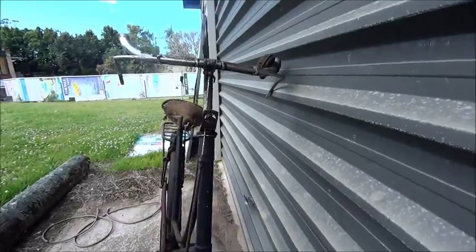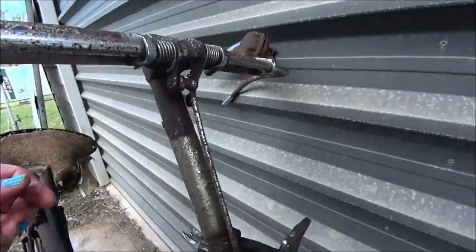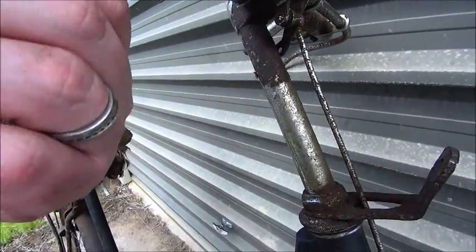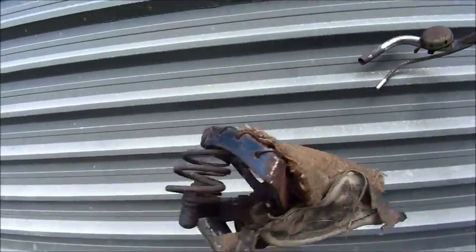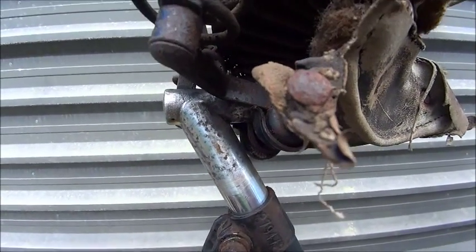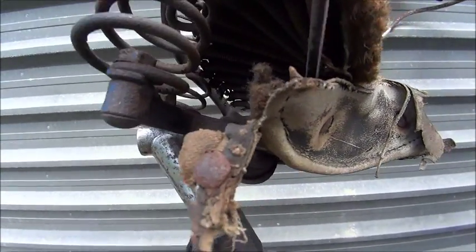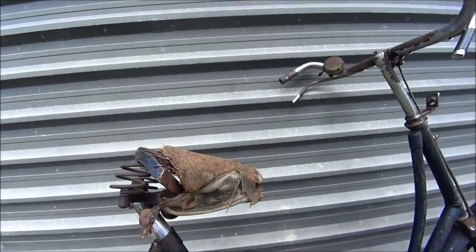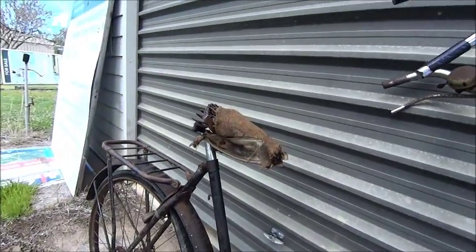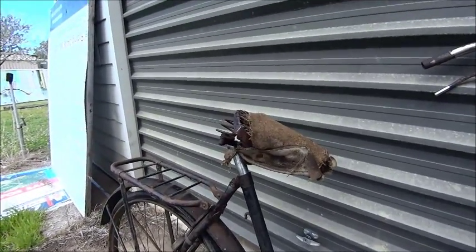Apart from that it's just a matter of pulling things down and stripping them back. I'm not sure how the frame is going to clean up — it's quite pitted. I'll drop it in the electrolysis bath. I've already done this one and given it a rub up with some emery cloth but it's still quite pitted, so I'll have to think about that — there must be a way to fix it. Anyway, that's an overview of what we're going to need to do to restore it. Thanks for watching guys and don't forget to subscribe.